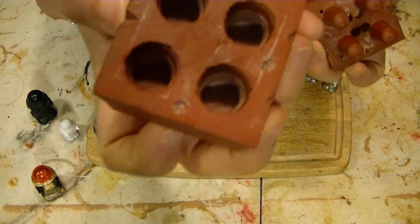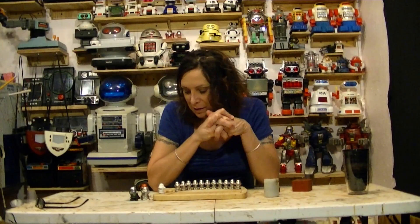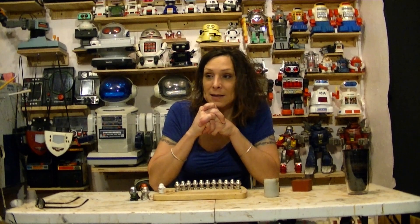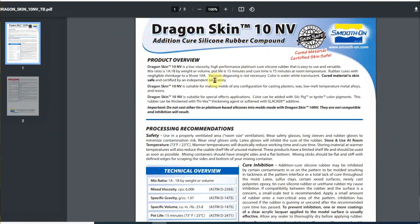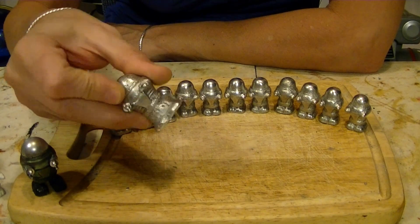You really have to do two-part molds like this — you're not going to do a dump mold, which is what a robot would be. So I was looking around on the website at the Dragon Skin, and the technical information says right here that Dragon Skin in tin can handle low-temp alloys. I talked to the guys at the Dallas store and they were kind of shocked it said that, but they said it could probably handle it for a while at least because they can handle very high temperatures. So I bought some, tried it, and this is what I got.